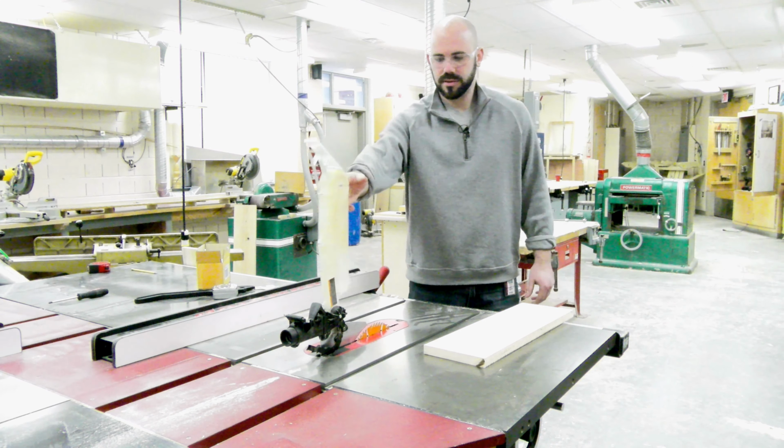All right, on this saw, it has a blinking light signifying that the blade is still spinning. You can also listen for the blade. I also recommend after you think it's stopped, you can wait an additional 20 to 30 seconds to make sure it's completely stopped. At that point, you can lift the guard if you need to, remove your scrap wood, grab your cut piece.